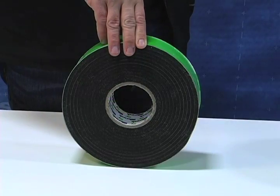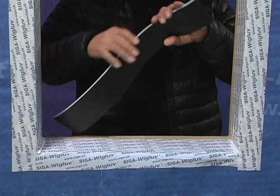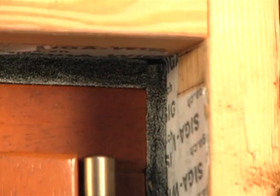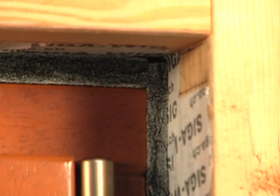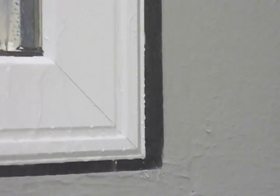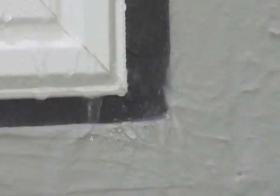The white-gray edge of Trio is always placed towards the interior. This coating is a functional vapor retarder when Trio is installed. From this point outward, Trio is vapor open — and being vapor open yet still airtight and weather resistant means the area around the rough opening can stay protected from wind and rain, yet still allow any moisture to dry out to the exterior in vapor form. For mixed and cold climates, this approach will increase the safety margin in preventing rot and mold.